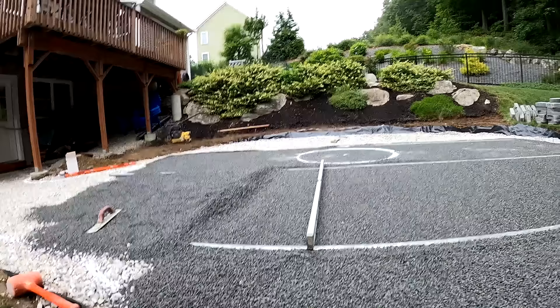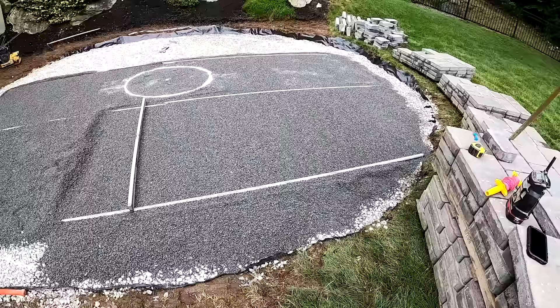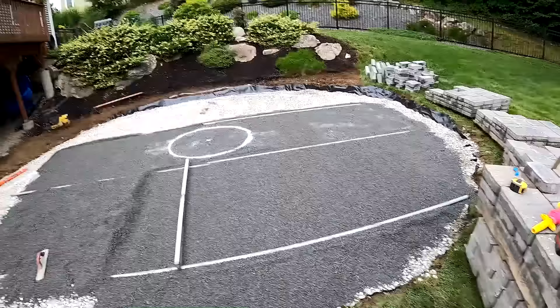The only thing I can say about screeding this way is: if you're not doing it this way, you've got to stop. You'll never be as accurate as this method just by putting pavers in by hand and troweling it off by hand. It's just a one-inch inner diameter gas pipe, so it's a little bit more than an inch outer diameter. You want that because they're a lot stronger — the pipes won't bend. You don't want to use thin aluminum pipes or fence pipes because they're thin, they bend, and when they're warped they'll really throw off your patio.